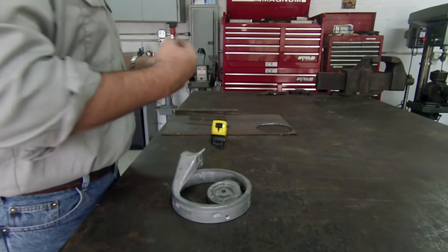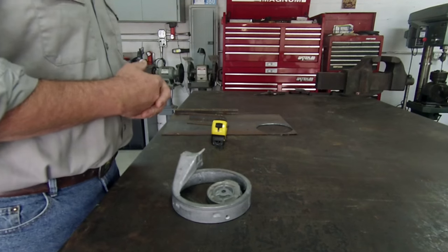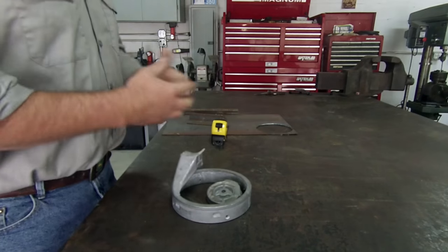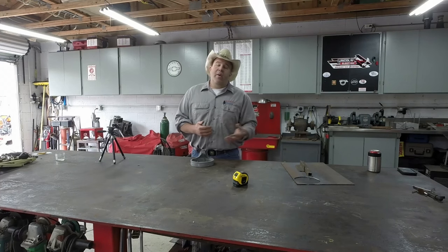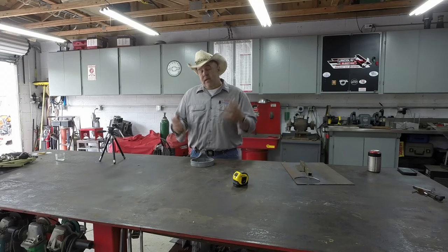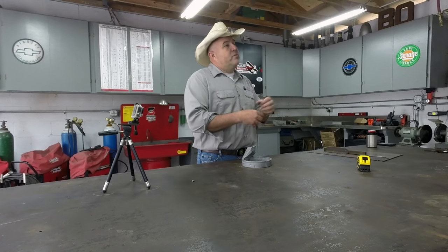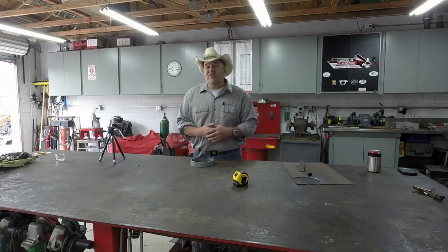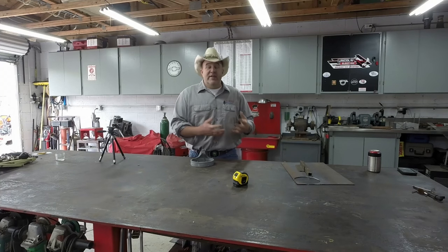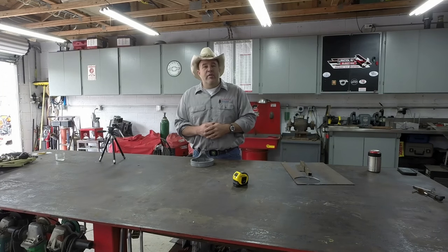Even if we clean it — with all-clean, with acetone, with a commercially available aluminum cleaning product, with a stainless steel wire brush, with non-chlorinated brake cleaner — we can use a whole series of things to make sure it's super clean, and as soon as we weld it we get junk in it. There's nothing we can do about it. The way I've always treated it, and the way many other welders I know treat it, is: if you weld it, you know it was clean and it's got junk in it — just grind it out and re-weld it. By grinding it out we're mechanically removing those impurities, and hopefully we're back to good metal because we've liquefied it and allowed them to float out. Now we come back and weld it again. I've had to do it as many as four times with really bad junky cast metal, and about the fourth time it was perfect. Most of the time you really only have to do it once.